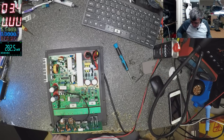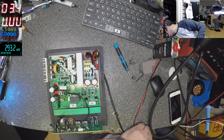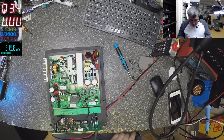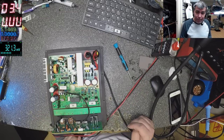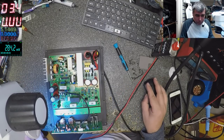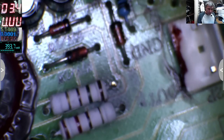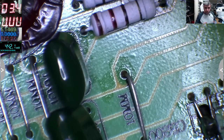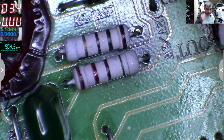Okay, let me unplug this because I think I know what the problem is here. It is unplugged. Wow, not all things are hot. So let me switch. I can't see. Anyway, yeah. What do we have here? How can I explain it? It's hard in English. We have like a voltage reduction by a resistor and by a Zener diode.